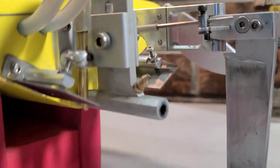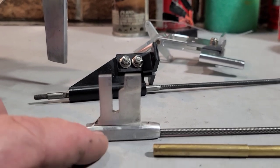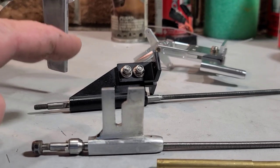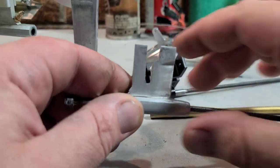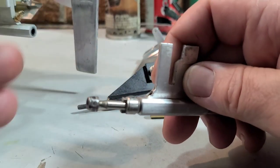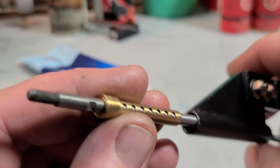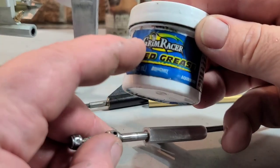Another really common and hard-to-trace area where water gets in is through your strut or stinger. Say you've had your boat for a couple of years, the boat never leaked, and then all of a sudden you start seeing a trickle of water that gets worse over time. The odds are your strut bushings are worn out. There are actually bushings in your strut that can wear over time from natural wear or lack of grease.